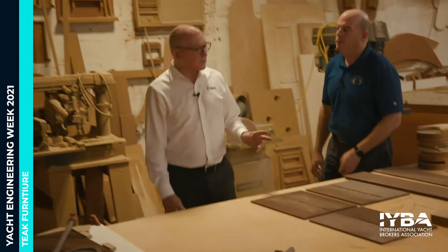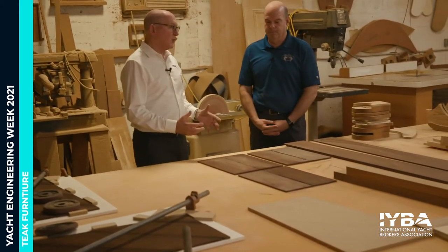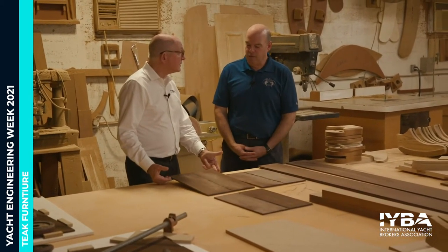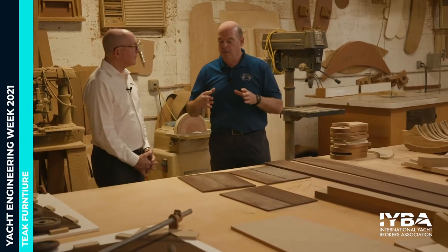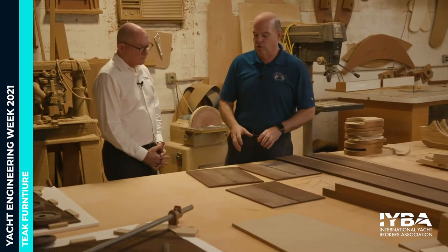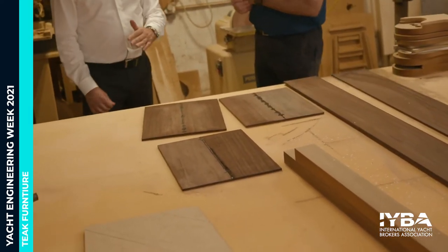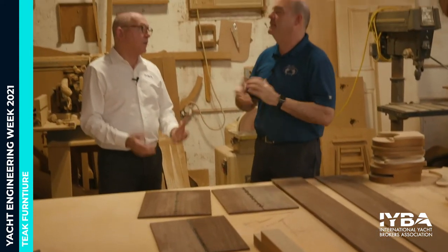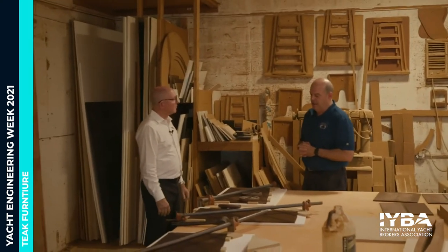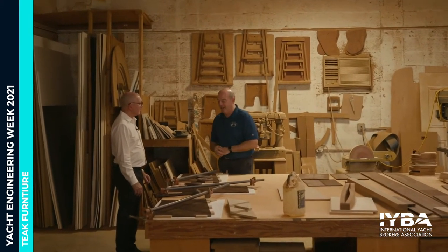These are the sides of the base for that cocktail table. Wenge being a difficult and expensive wood to obtain, the smart play is to butt join. We want to make sure we continue with our graining — matching the pieces of wood and grain together as we butt join them. Our head carpenter only does this on weekends where he can concentrate on each and every piece. It also gives amazing consistency in color and grain, which provides a piece of art when you're done, not just a piece of furniture. The tough thing about Wenge is splinters — it's a tough wood to work with.